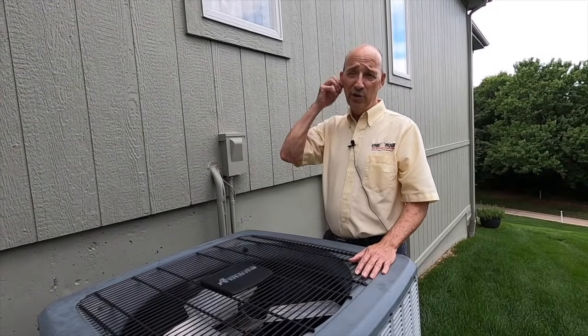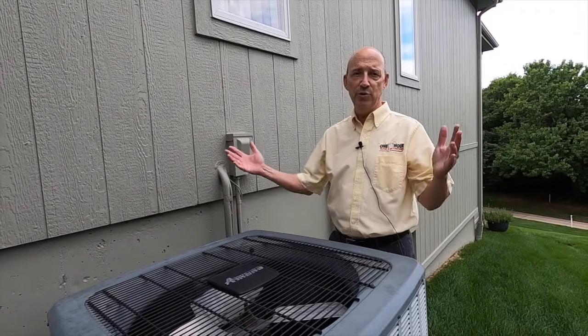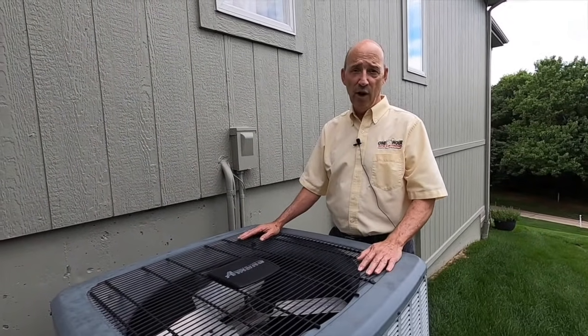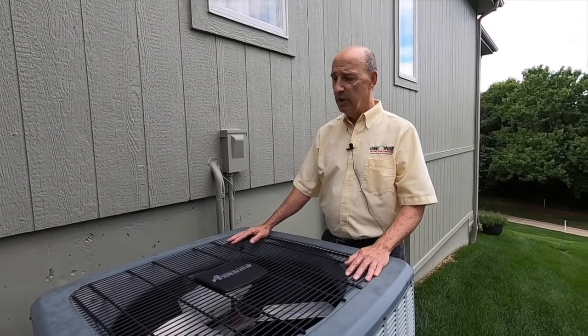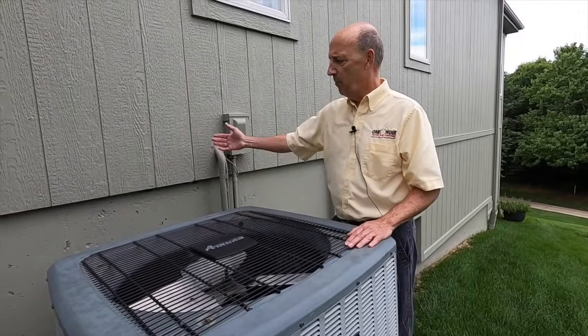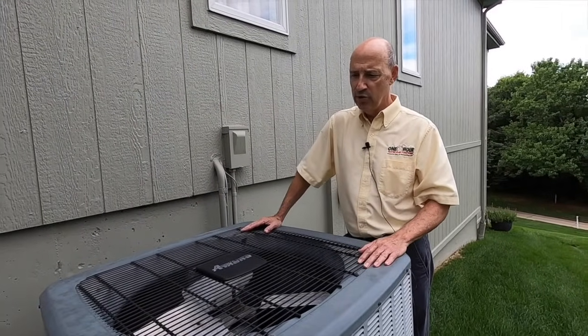Now we're dealing with the air temperature, so sometimes it can be in the sunshine, but still the air temperature is what it is. We certainly like to keep it away, whenever possible, from dryer vents and heat generating exhausts and things like that. But really just make it so it's ease of accessibility, keeping the landscape kind of cleared back away. That's the biggest thing, is keeping the proper distances away from the house, as well as keeping the area clear of shrubbery so it can breathe.